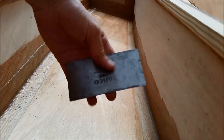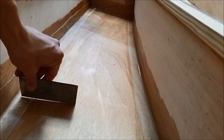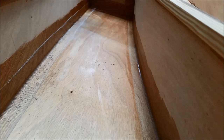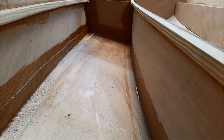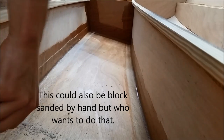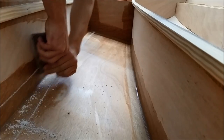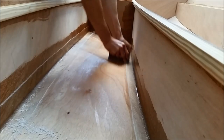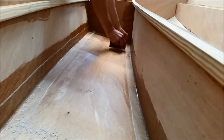If you don't have a power sander, you can use just a cabinet scraper. I'm going to demonstrate that here. I'm just using a little cabinet scraper to scrape the edges of the fiberglass, knocking off the hard edge all the way around, getting the tape ready for a coat of epoxy.